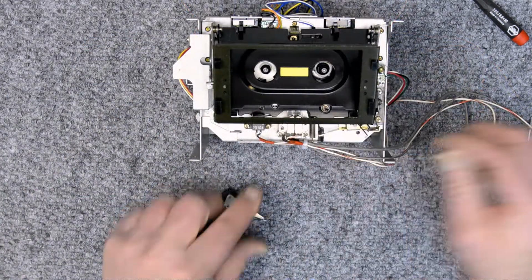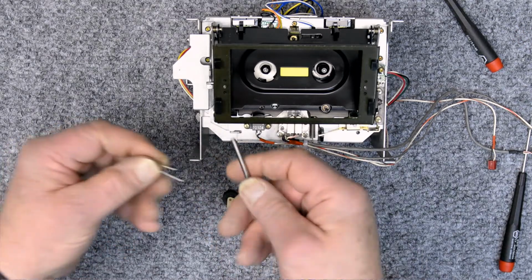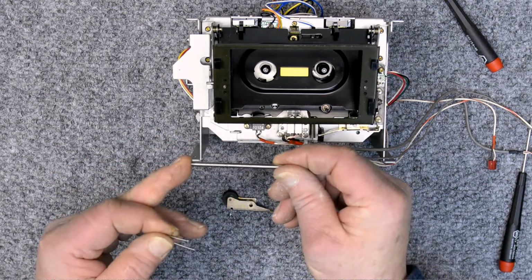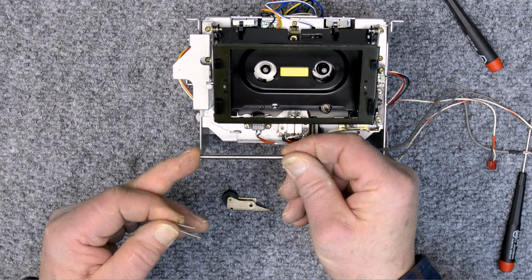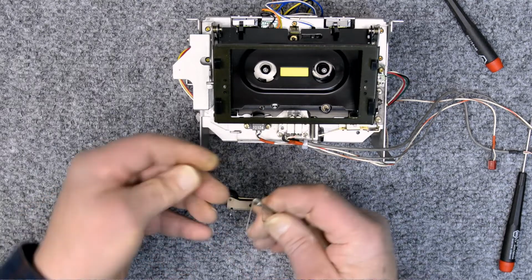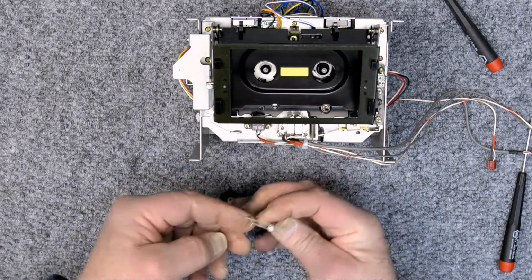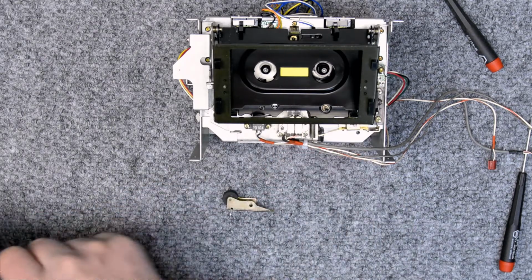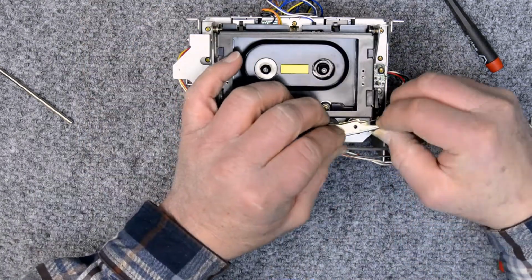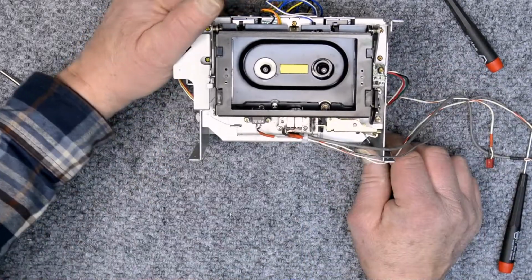So let's get the right tool here. And I find a gauge pin that I happen to have, and I think it's a 3.97 millimeter. I can't remember exactly, but it's a very odd number. And yes, I had that in my toolbox. But that fits that perfectly, and then that way you can adjust around the correct diameter. Put it back in, check it again.